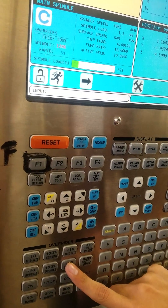The load is still at 30%. I personally think we should have a separate feed rate for plunging down versus feeding around. It probably would use a smaller tool. We could change the tool easily by just changing the tool diameter offset.